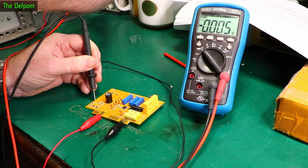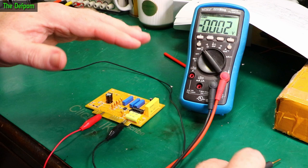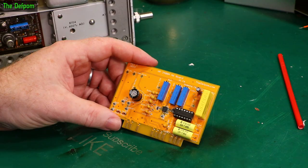It's going through some big resistors so it's actually cranked up — I've got almost no current draw. Let's go to 31 volts. There it is — 5.8. So the supplies look okay. There's a slight sag; this is probably using Zeners which aren't perfect — it's 0.2 volts off, which probably doesn't matter. It does have nulling on here, so I think I'm okay to put the chip in and actually try putting it into the unit to see if it works.